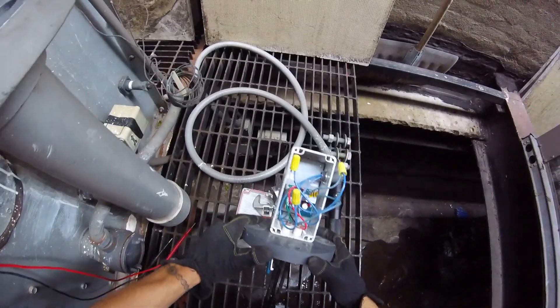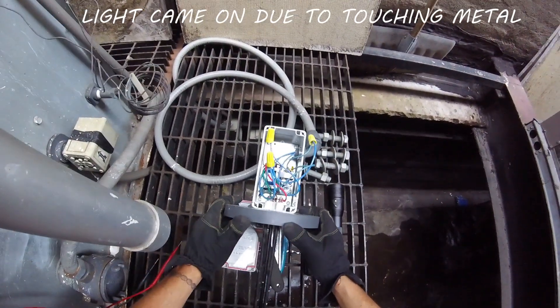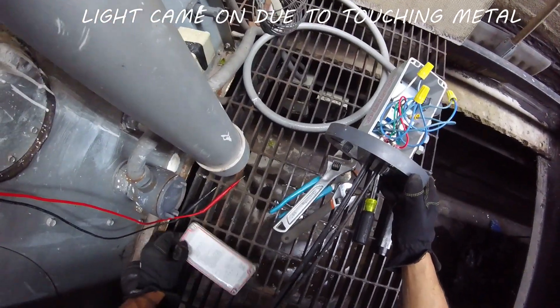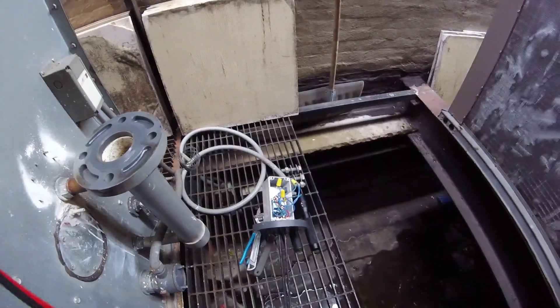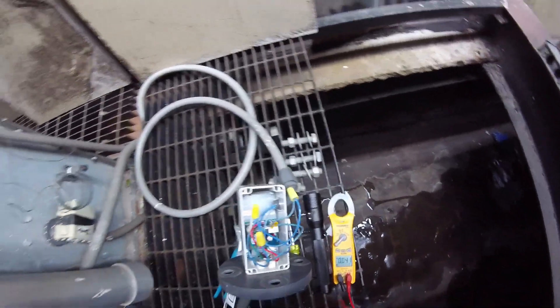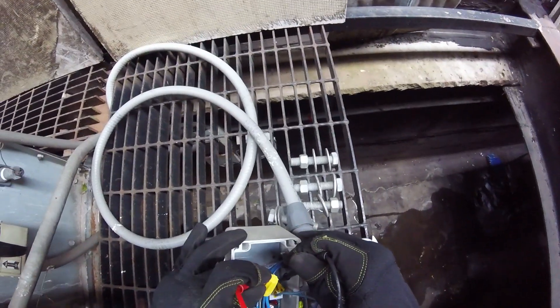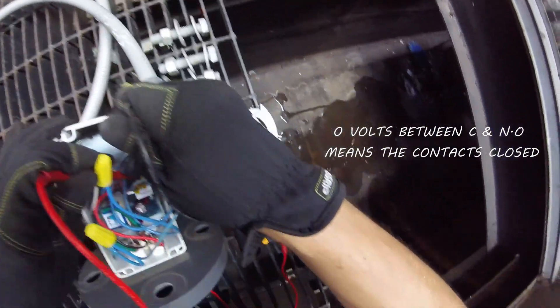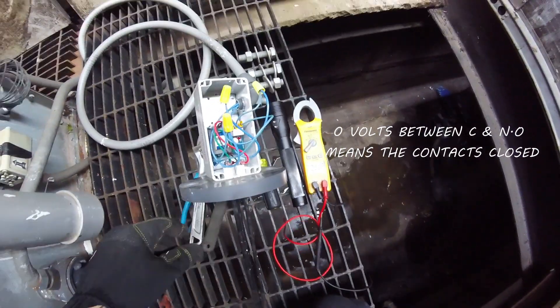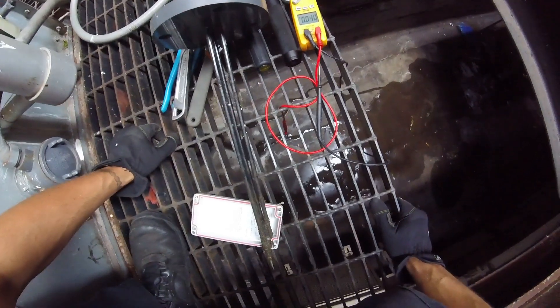Let's put this safely down — we don't want to damage it. The light just came on randomly, that's weird. It's full of dirt. Let's make sure with my meter that our circuits actually close, because just because the light went off doesn't mean it's sending power or not. We have a voltage drop of 17 volts — actually, zero volts. These contacts did open. Look at that dirt on there — that's no good, definitely want to get that cleaned up. That could be an issue right there.